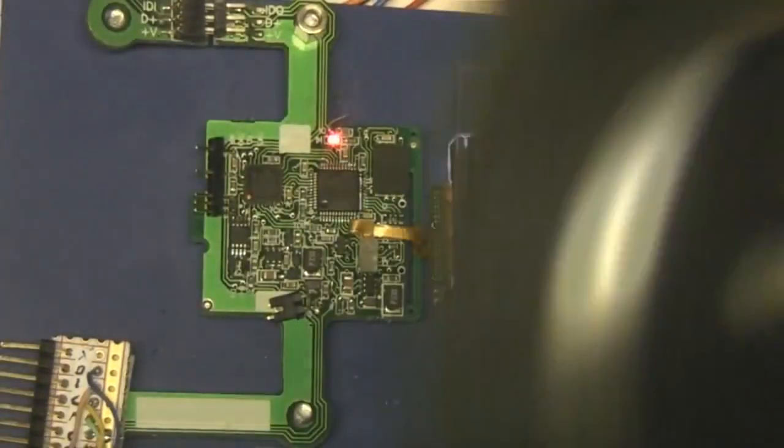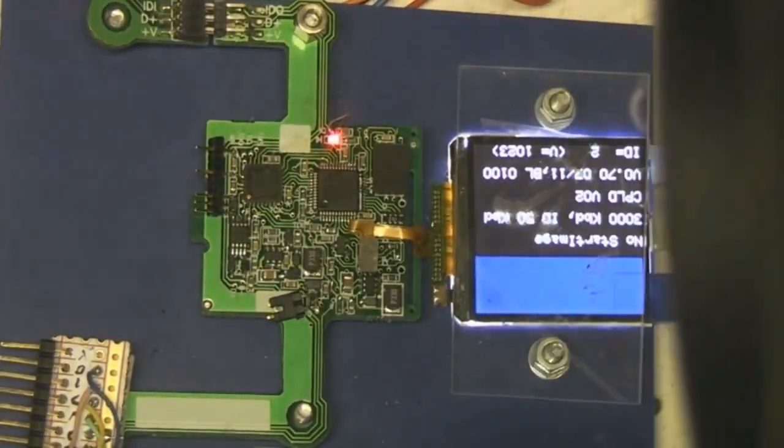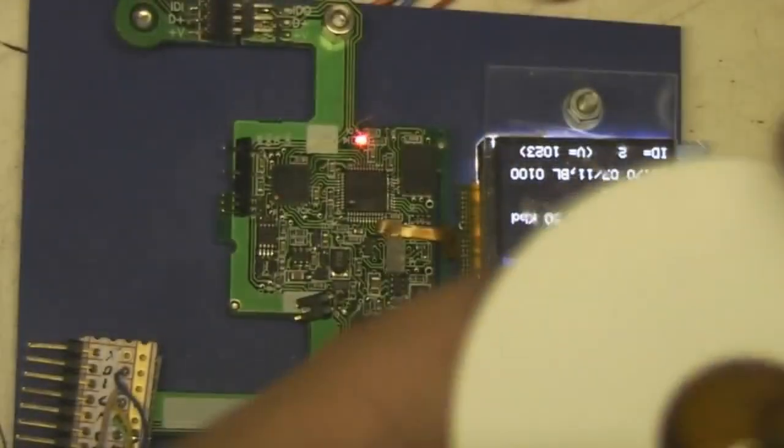On any camera system there are two ways of making it focus closer. One is to actually screw the lens further away from the sensor, which is possible to do on this. The other is to add an external lens. Because it's a thermal imaging camera you can't use a glass lens — you have to use a lens that's transparent in long-wave infrared. The options basically are germanium, gallium arsenide, or zinc selenide. Zinc selenide lenses are actually available quite cheaply as laser cutter lenses. I ordered a few different focal lengths from China — these are about 20 quid, about 18mm diameter, available in focal lengths from about 22mm up to 100mm.